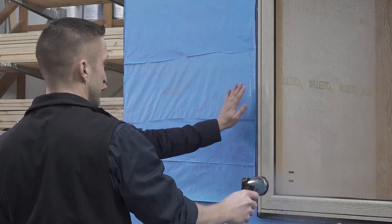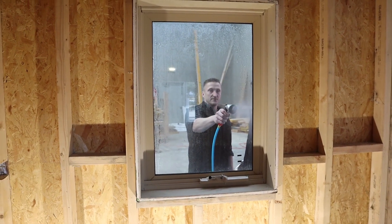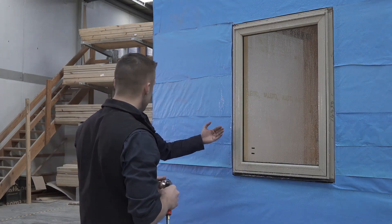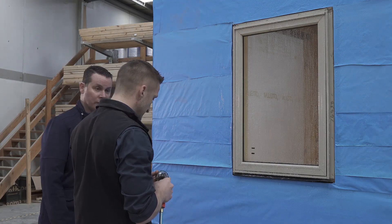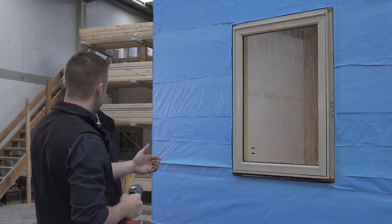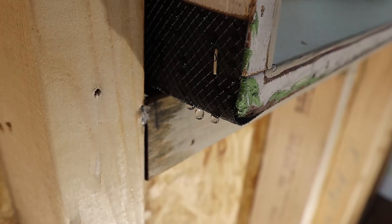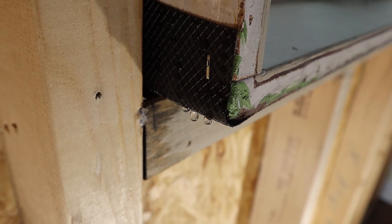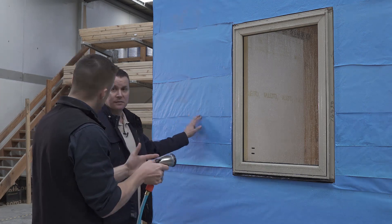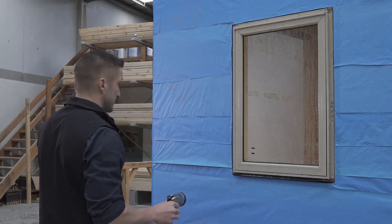You can clearly feel airflow around this window, especially on the sides too. It's 30 km/h wind — not anything extreme. And if this water gets in, all the insulation under the window is going to get saturated. And it's not just the insulation — the most concerning part is the structural components in there. If the structural components start being wet inside the wall and you've got a non-diffusion open membrane, all of a sudden you're closing that moisture into the wall structure, and that really results in structural damage.